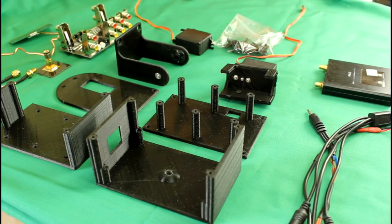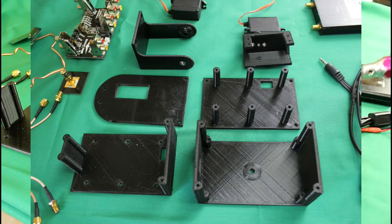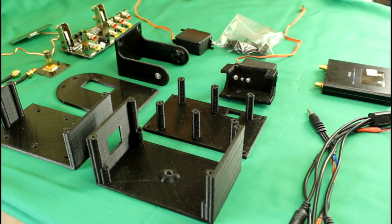This is what you'll need for the Eagle Eyes Antenna Tracker. First, download the 3D files from Thingiverse and print them out — you should have six separate pieces. You'll also need two servos. These need to be 180-degree servos, which you can get from eBay or Hobby King. They need to turn through at least 180 degrees, so normal RC servos would be unsuitable. They can be had quite cheaply; there's no need to get expensive ones.